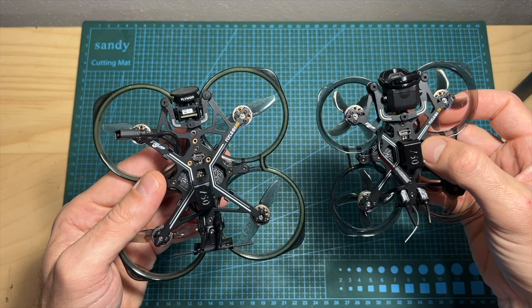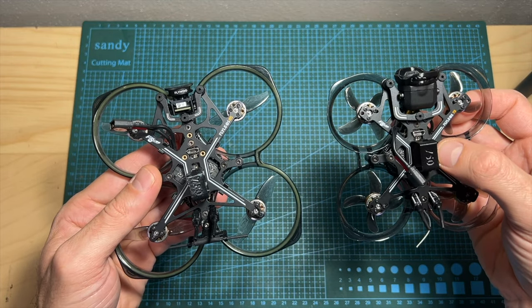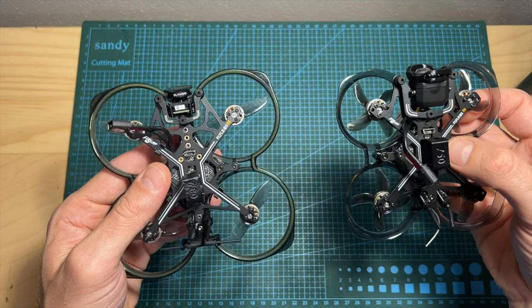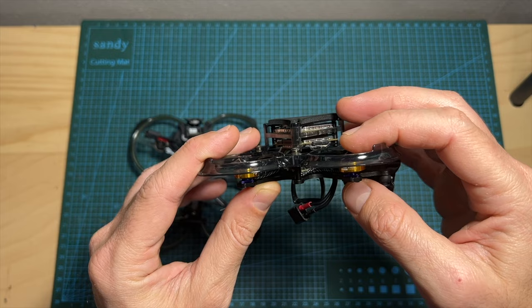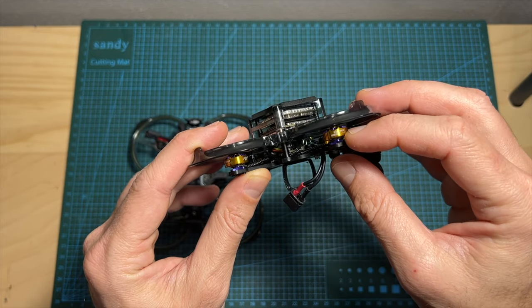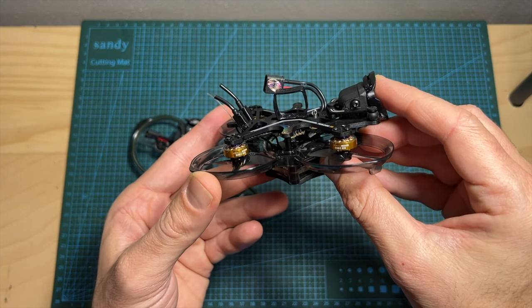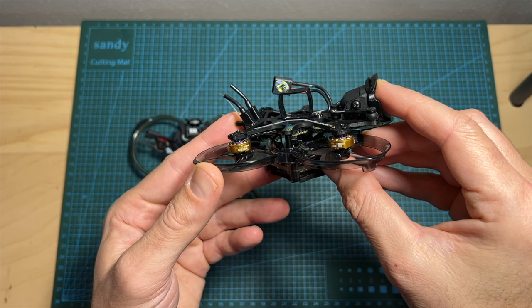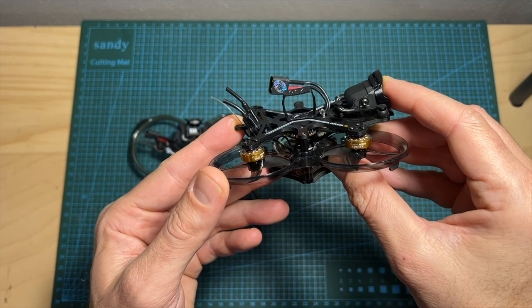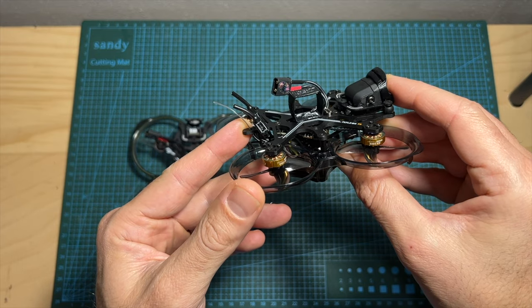In terms of features and specs, the FlyLens75 is using the same electronic components as the FlyLens85, so it features the Flywoo ROBO 1003 14,800 kV motors and the GOKU Versatile, an all-in-one F4 flight controller that features an MPU6000 gyro chip and an integrated 12A BLHeli 4-in-1 ESC that comes pre-flashed with BlueJay firmware.